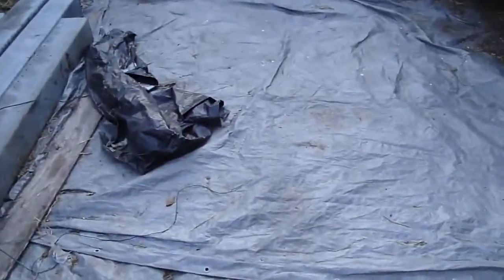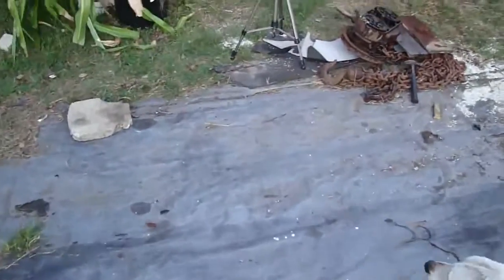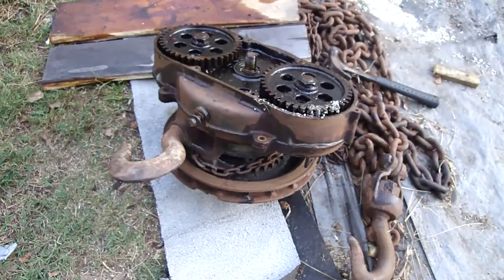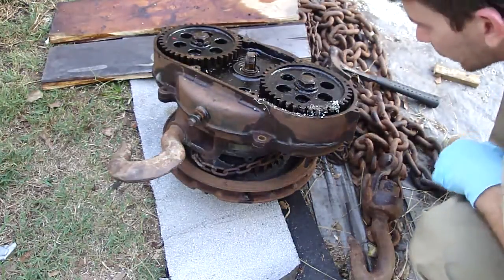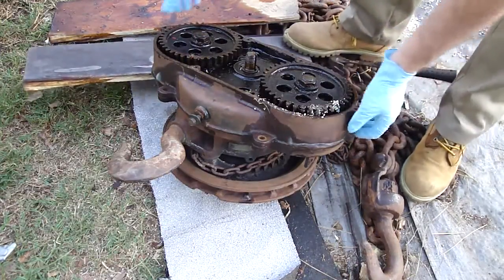I was building a trailer dolly so I could get the trailer back in the yard before somebody stole it, but it's back in the yard and I didn't need the dolly quite yet. I used the rope and some pulleys — leverage. So that task is over, I can go back to working on this. I've got the woodruff key out — got it out with an awl. I hammered down into it and the key stock was soft enough, not hardened, so I was able to drive the awl underneath it and pry it out without doing any real damage to the shaft.